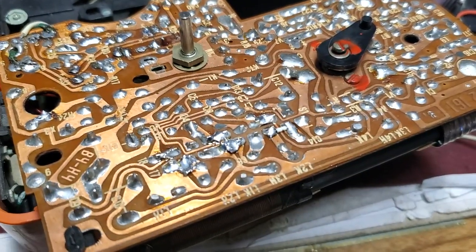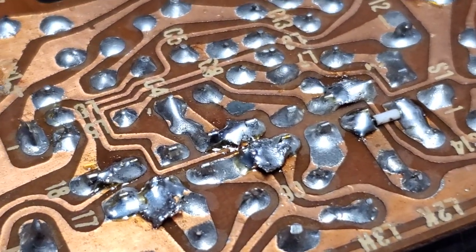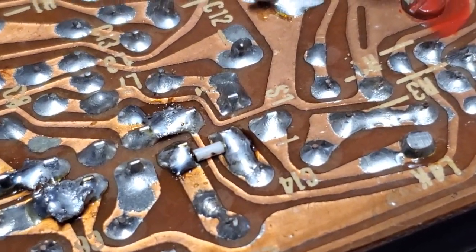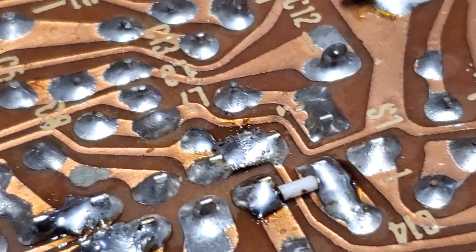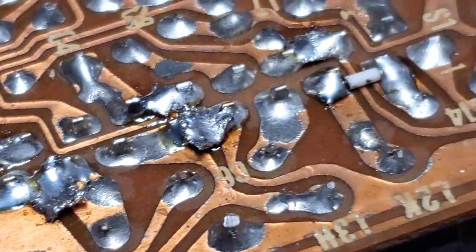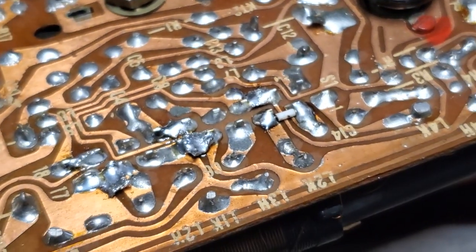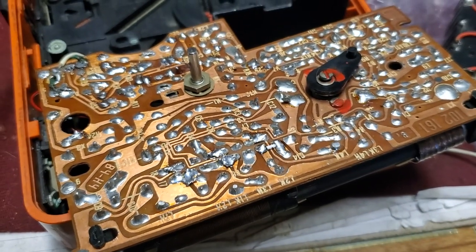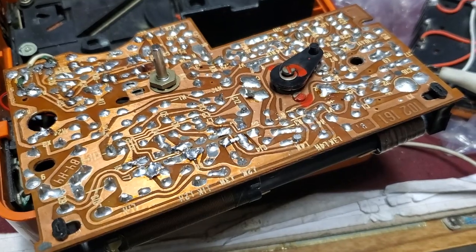I just deleted the switch in place. I just bypassed it. I just jumped over. You can see there, I used a piece of wire to go over the top of that. And yeah, it's just manually put in medium wave or AM broadcast band. Because I'll never use it in long wave, so I might as well make it reliable in the band I'm going to use it.